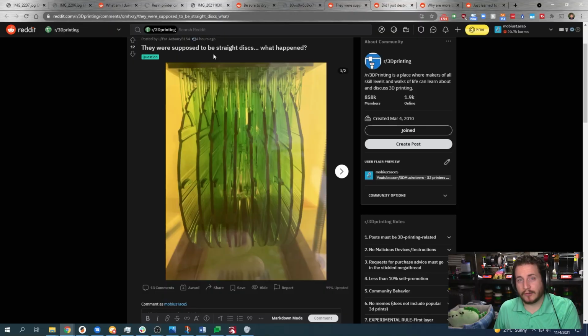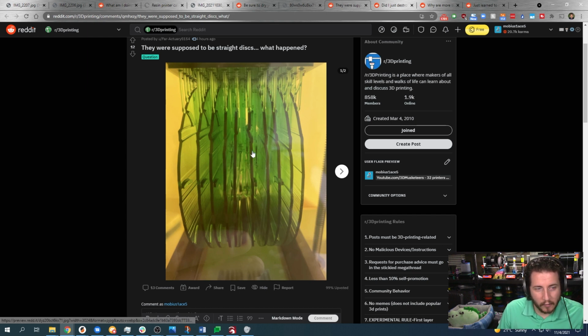I think orienting these instead of being vertical to have at least a 15-degree tilt would definitely help. Yes, that means you'll be able to fit less of them on the build plate, but ensure that they print well. I'm going to go ahead and take multiple prints over failures any day of the week, because ultimately this is all trash, unfortunately.